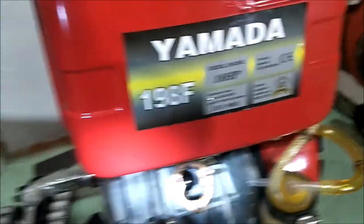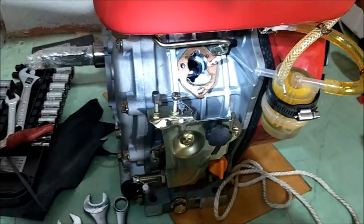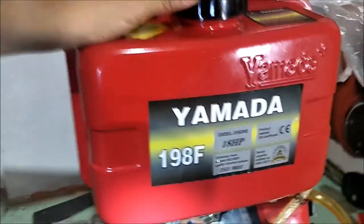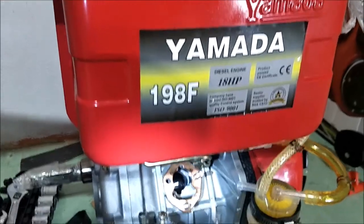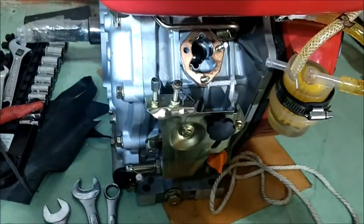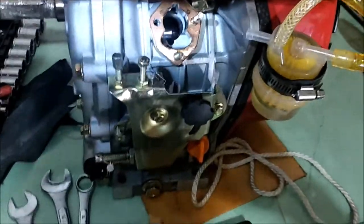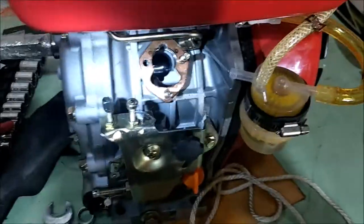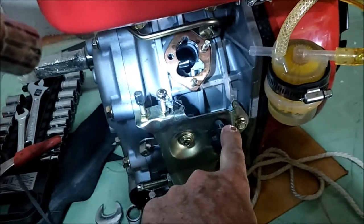These are pump boats in the Philippines. The boats are called pump boats because they use water pump farm engines that originally pumped irrigation water. They've now become more of a marine type engine. This is an actual marine adaptation of a water pump — the kind you'd connect to pump your rice fields full of water, or drain them. If you're pumping, you probably want to set your throttle to a certain speed and have it just run and pump water in or out of your field — that's why the fixed throttle is there.